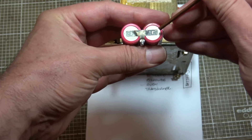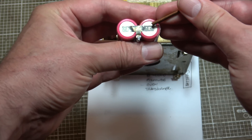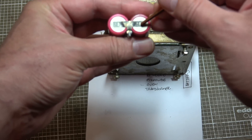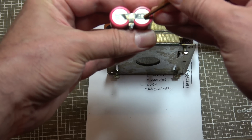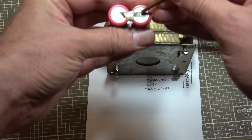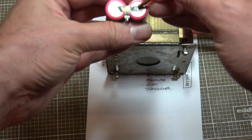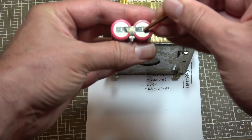There are actually a few refinements you can do in this process. The one I want to implement in this controller is what's called double pulse welding. When the electrodes press down on the nickel strip they're not necessarily making a perfect contact, so what you do is send a very small pulse through just to soften the metal. Then, during a short delay, the pressure of the electrodes deforms the slightly softened metal to make a better contact. Then you send another larger pulse through to actually melt the metal properly and fuse it together.